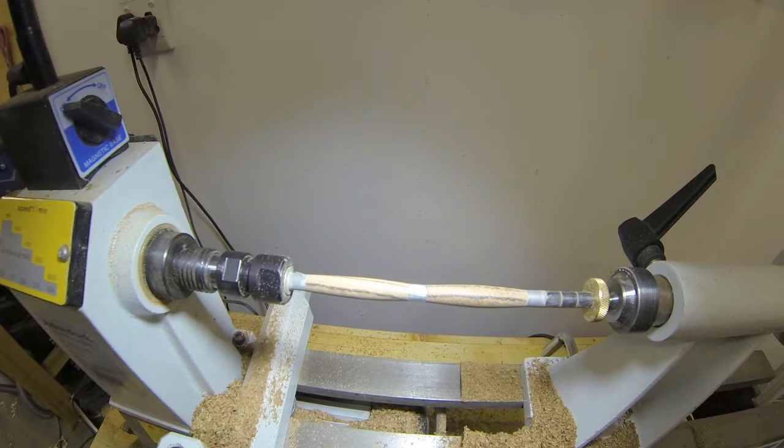Okay, so we've skipped through the sanding. Sanding is done now. So next thing to do is to actually clean up the blank. For this, we're going to use a little bit of rubbing alcohol. Ideally, you want to use a denatured alcohol on this type of application, but denatured alcohol is practically impossible to find in South Africa unless you get the colored version, which is called methylated spirits.